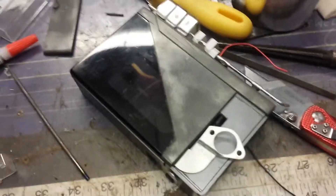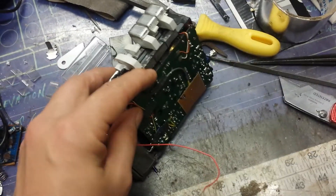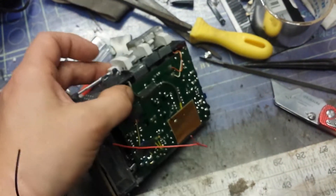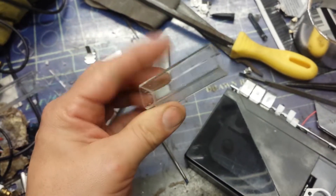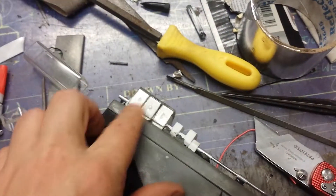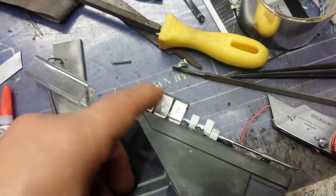This is the Walkman that I bought. I cut the front here where the cassette door is. And most notably, I've got these styrene pieces which engage the existing buttons so that you can push them and they activate. Now I'm adding these pieces that I'm building out of this piece of acrylic tube that I got at a Creative Reuse store here in Pittsburgh. These button faces make it much easier to press these buttons. As you can see, that clicks in — that works.